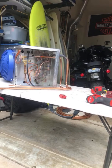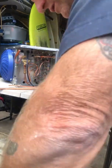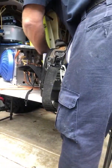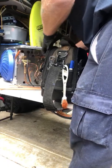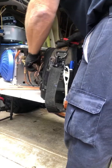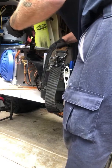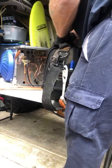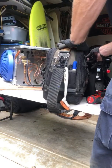Okie dokie. So I did get a new solenoid valve, but I'm going to install it where it's installed at the old one, just because they already had their electrical flex run over there. And because I have to upsize the solenoid valve to 3/8 also. The size of your valve is also going to dictate how much refrigerant's flowing, and you'll lose BTUs. So you want to make sure you've got the right size solenoid valve for your system, as well as your line set, your suction line.